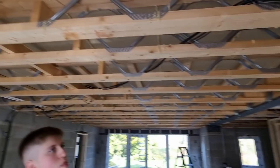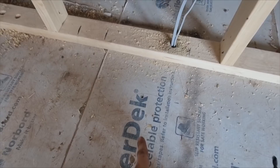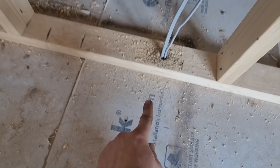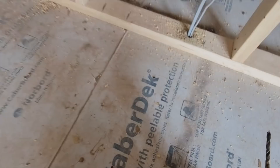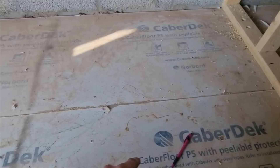I've just come back upstairs and working out where my shower waste is going to go. It's a JT tray so they're always 130mm or 135mm in from the corner. We just need to make sure it misses the joist. It says 1600 by 900, so it'll either come here or there on the JT trays. If that misses the joist and I've got a nice big area I can cut this out - I've run a two inch from over there, it's coming along and then it'll just elbow across to here. I'm using swept bends on it as well so hopefully it's got a good fall.